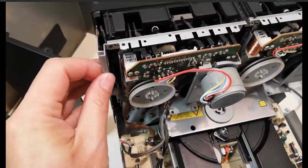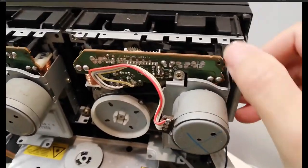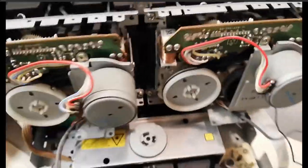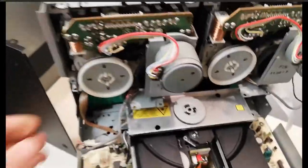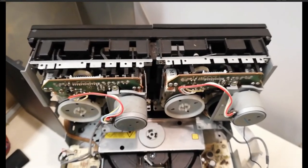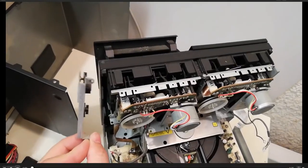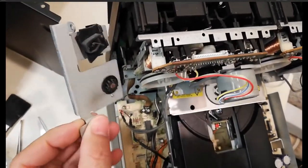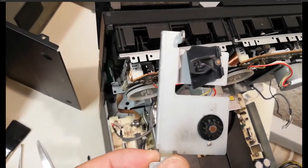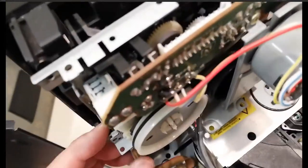So he's right to replace it, but the thing that was wrong with it, I had to really investigate why it won't spin. So I think here my next step was to remove the cassette transports so I can get into removing the CD. So these had to come out anyway for a good clean, I think. So I started removing some screws, and here I'm trying to take that tab at the side off, and the trick is that you have to have the tape deck open for it to release the contact on that side. There you go. So you have to have that open, and that just pulls off, and you see it holds it back in by connecting down there. So, and I was trying to focus on that. Is that rust? I was asking. No, it's just brown.